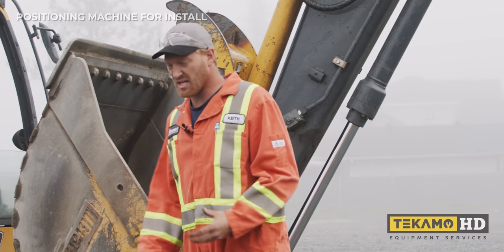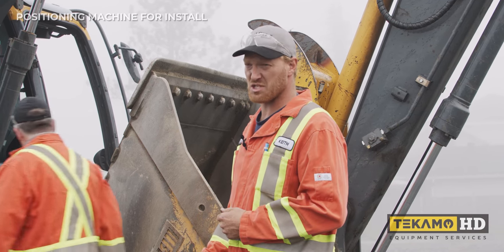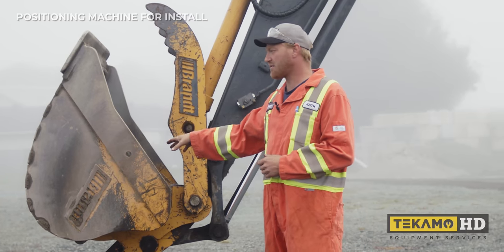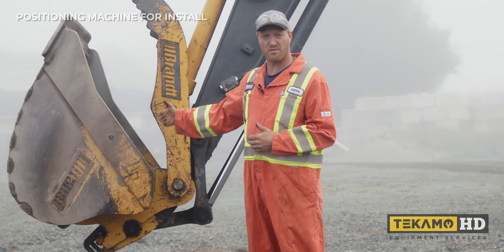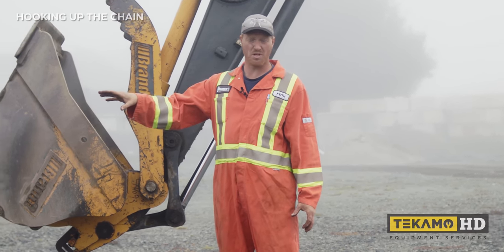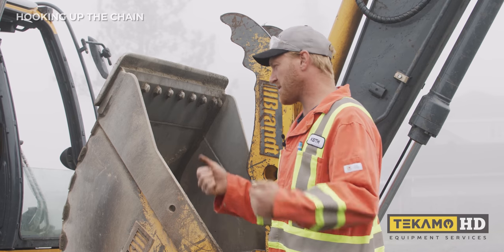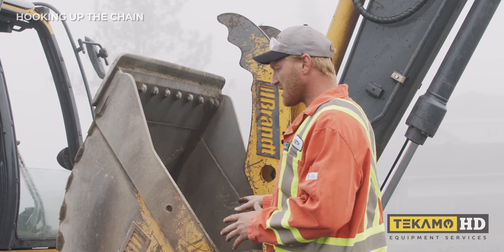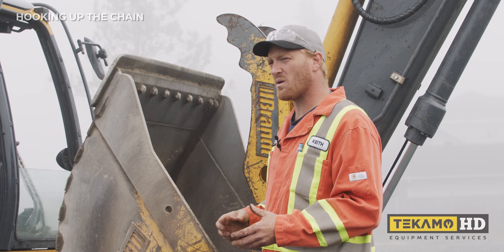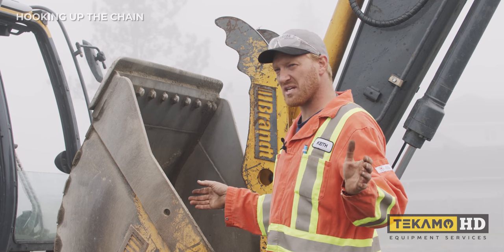Now that I'm on this track — because this pin can only go in from one direction, we have to put it in the way it came out, from the inside of the machine. Because the blade is on the front, I have to put the pin in on the sprocket end so we can get our driver in there. Now we're going to hook a chain up and use the machine to pull the track on. Once hooked up and the chain becomes tight, you want everybody standing at least the length of the chain distance away for safety, because the excavator has a lot of power and it can break the chain.